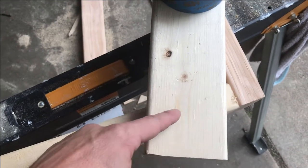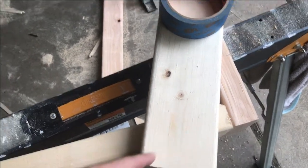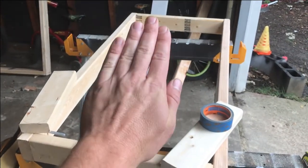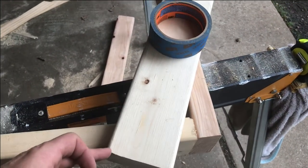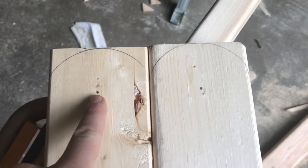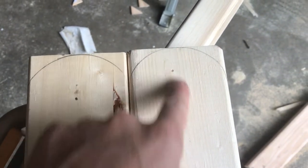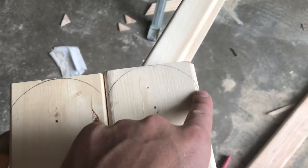The last bit is we've got to cut a 30-degree angle on the leg. If you've played beanbag toss, you know the board sits at an angle — it sits at a 30-degree angle. So on our legs, we're going to cut a 30-degree angle as well. We've got them measured at an inch and three-quarters in and an inch and three-quarters down on both sides, and the arc is drawn up at the top. Next steps: drill the holes, round that out, and cut the 30-degree angles.